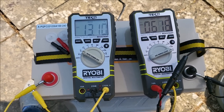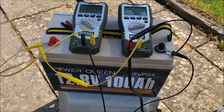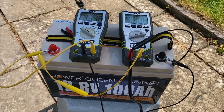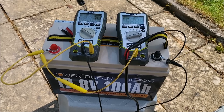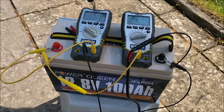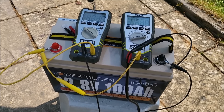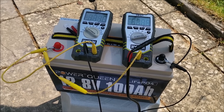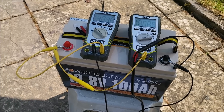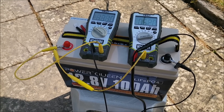Let's get the solar panel connected up. This is going to take quite a long time — possibly a couple of days. I plan to charge this until the BMS shuts off, so I'm actually testing the cell over-voltage cut off. Then I'll do a full discharge and measure capacity until I get a low voltage cell cut off. And in a separate video I'm planning to dismantle this battery, even though the manual says not to, because I think we'd like to see what's inside.